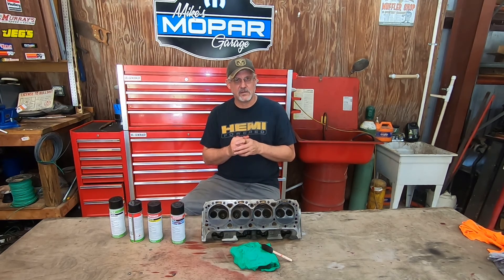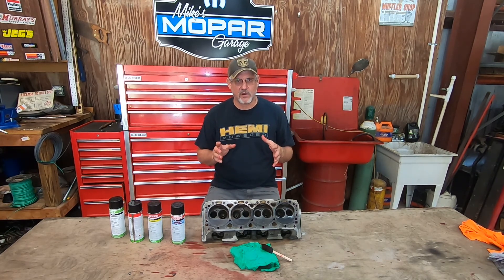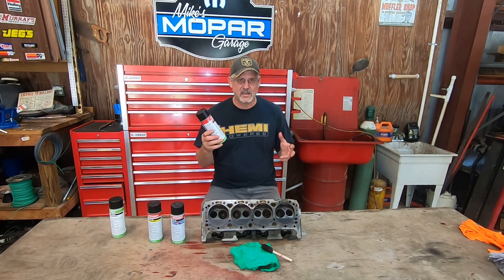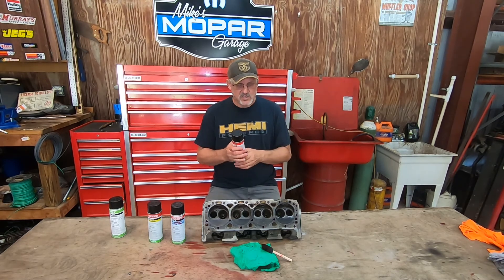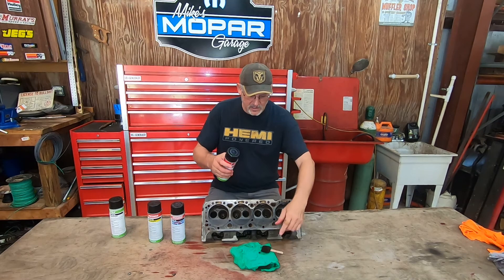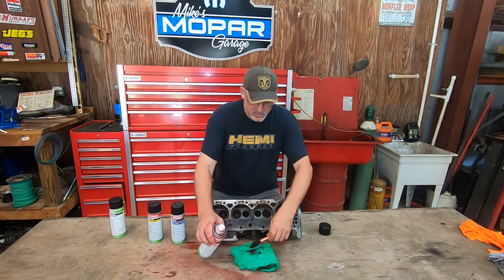Once you've got it all clean, we're going to apply the penetrant. Here's where I really cringe watching other videos. This one can of penetrant can literally paint a battleship — it goes a long, long ways. One of the tricks I want to show you to help with cleanup is to get a small paintbrush or a foam brush, spray a little penetrant into a rag, and just load your brush up. I already know where this crack is, so I'm going to apply just the penetrant to that spot to speed up the process, but normally you'd apply it all over.